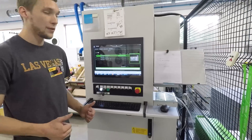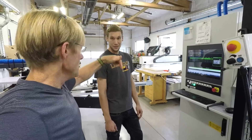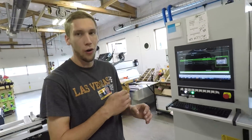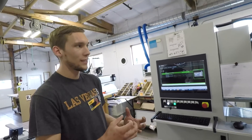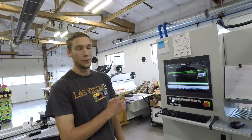With the cutouts, now that we're using a Forstner bit instead of a router bit, you get perfect holes — perfectly round, no movement at all. Before there was actually a little bit of an oblong hole, because the way that CNC was moving and the way the tool was, it wasn't really getting the best quality hole. But now that we have a true 20mm Forstner bit, it's going to fit all your bench dogs perfectly — an absolute perfect 20mm hole. So we're going to get a more precise bench and cut the labor cost, which means we can keep the cost of the bench down.